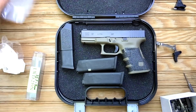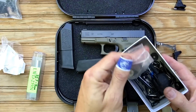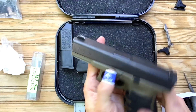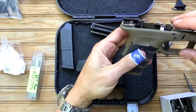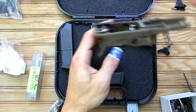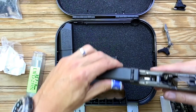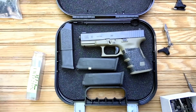I have a bag of triggers — some are polished, some aren't — and a bag of recoil springs and trigger springs. I just swapped one in; it's a little smoother trigger pull. As you can see it's polished, and all I do is use a Dremel with a little Mothers or Flitz. It's pulling smoother and it didn't lessen the break any. I'm actually waiting on a trigger that should be here Monday or Tuesday.